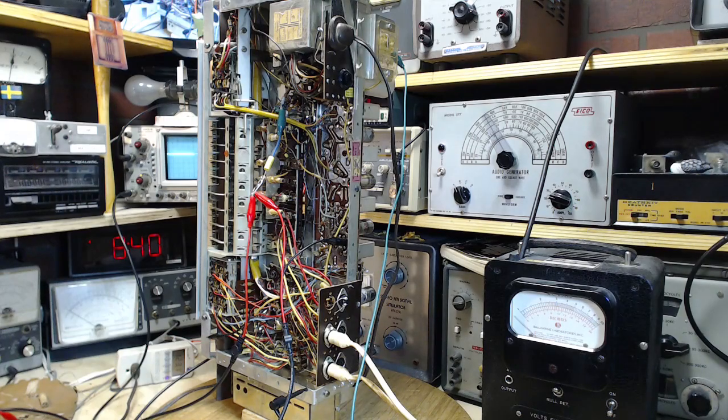So, just a recap. All this fiddling around is suggesting the front end for AM has something going on that's drooping the signal way down. The signal's weakened way off. It seems to be true of shortwave, though I'm not absolutely sure of that. So there's something in common between the shortwave and AM band, some component, something going on that I could probably find. I'm going to have to study the schematic and try to identify a couple of key candidates and problem causers, and then either change them out if they're capacitors or resistors, or do some more testing with a better theory of the problem.